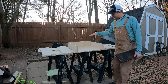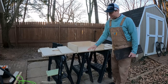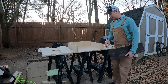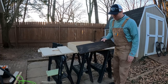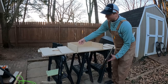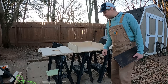I'm gonna do something a little bit different. Most of the time you make a full box with a front and then add your front piece afterwards, but because I'm using half-inch ply for the bottom, I'm going to forgo putting on this front piece. Because these are very solid pieces for our fronts — I had made these months ago when we did our upper cabinet doors and had already stained them — I will get these boxes put together by pocket jigging, and then do pocket holes through the side into the front face. The sun's going down so I'm gonna get this done tomorrow, and I want to sand down all these edges before doing all the pocket holes.